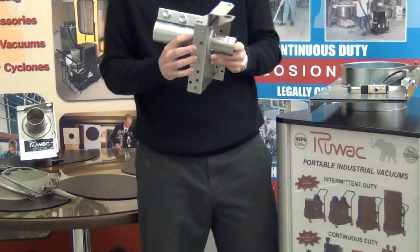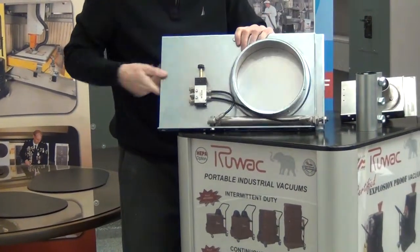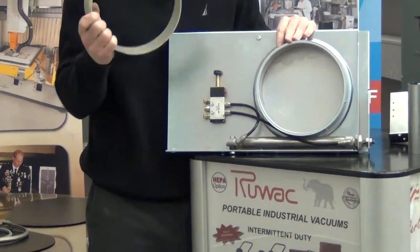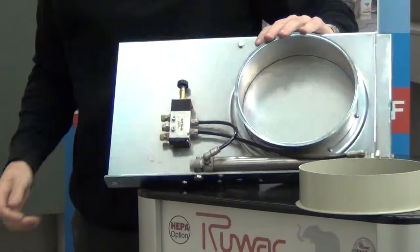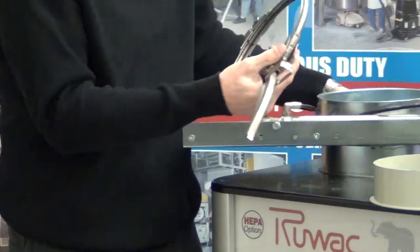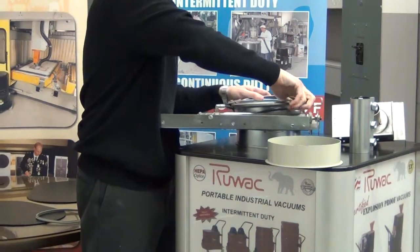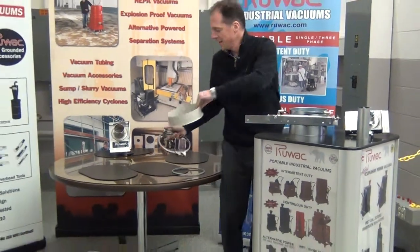So again, the 2 inch, 3 inch, 4 inch, and 6 inch are going to go together with compression couplers. The 8 inch is unique in that it has a flange on the outside of it. This flange allows us to use a weld collar. The weld collar will go onto the outside of the machine — this allows you to weld it to something else or connect it to your tubing system. Then to connect those flanges, you would use a gasket and a type of clamp that would go over the flange and allow you to clamp the two pieces together very easily.